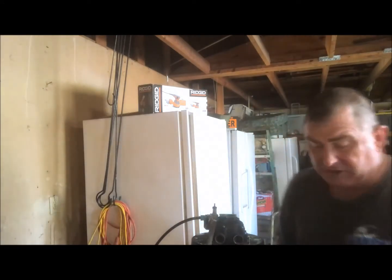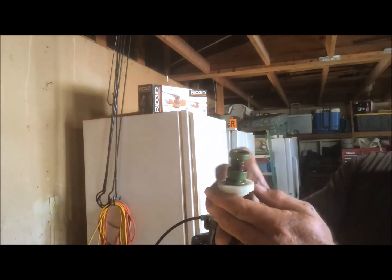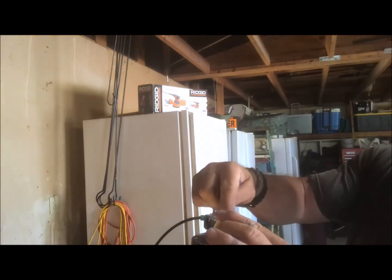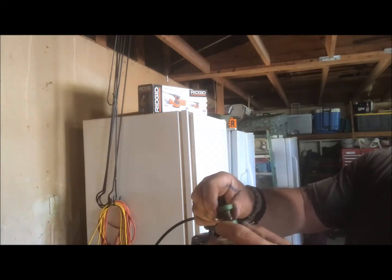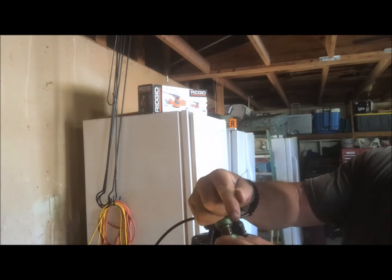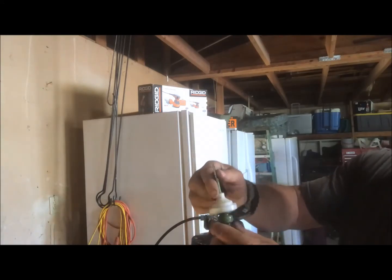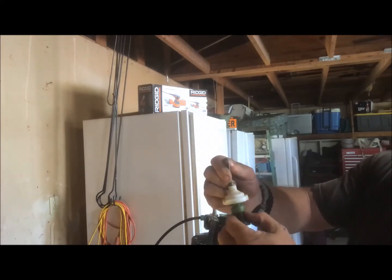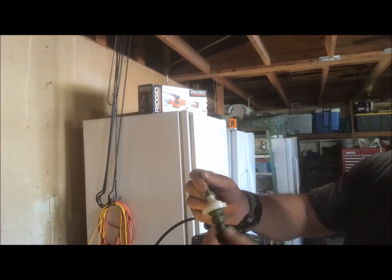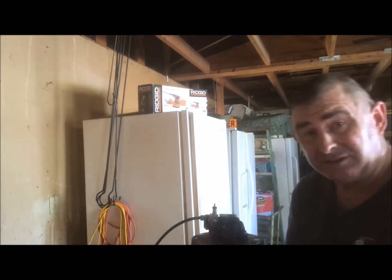Okay, this is a Teflon coated brass piston. The piston itself looks good. Usually you'll see some wear around. There's a little bit right there, but usually you'll see some real good wear around the one spot of the piston, because all it does is go up and down. So it'll wear one spot of the piston and wear this Teflon coat off. This red stuff here is iron and calcium, and so really the piston, in my opinion, is good.